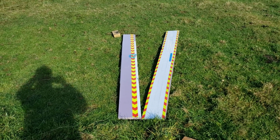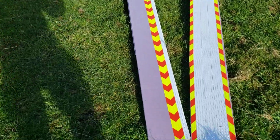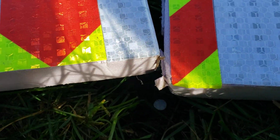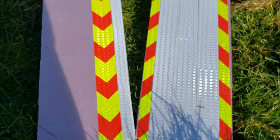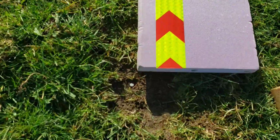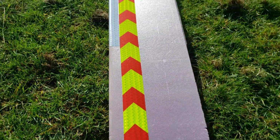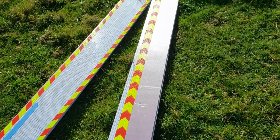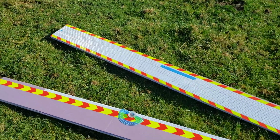Okay, this is the magnetic declination here. I have this styrofoam plank on the left with its edge lined up right here to the aluminum nail, the corner here. Basically, I got these both, their corners right to the nail. And then this one here is lined up with the nail, the other nail. So this one's at true north-south along the true geographic north-south line. This one over here is approximately pointing magnetic north.